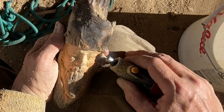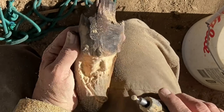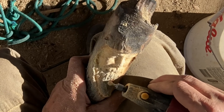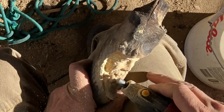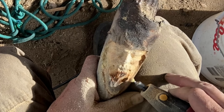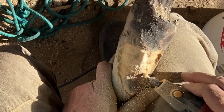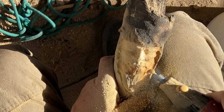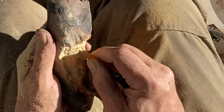I use two different kinds of rotary tools. I use the basic Dremel-style rotary at the start, and then at the end I move over to the Stylo Plus — it's more of a light-duty rotary tool but it's perfect for details. The only downside to the Stylo Plus is it's got low torque, so if you really gouge into the wood it's gonna stop the motor. It's a safety feature, and then you have to restart it with the on/off button, which can be kind of annoying. But once you get used to the tool, you'll know how to work it without running into that too much.